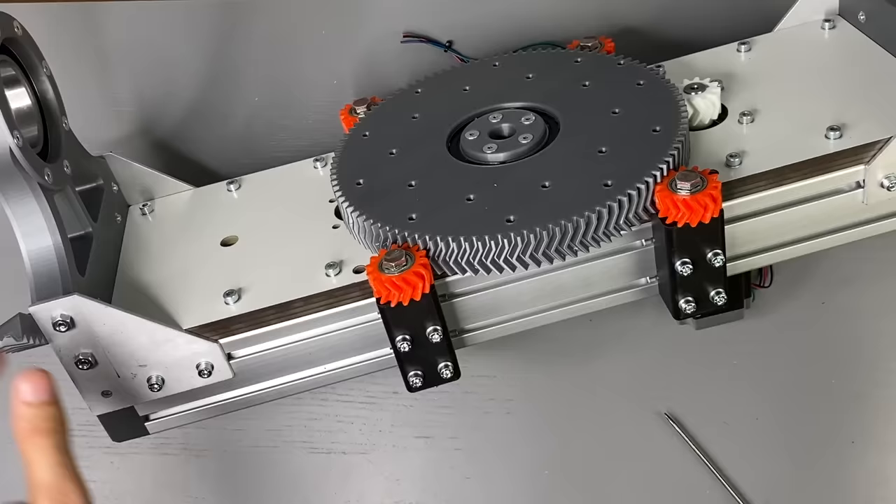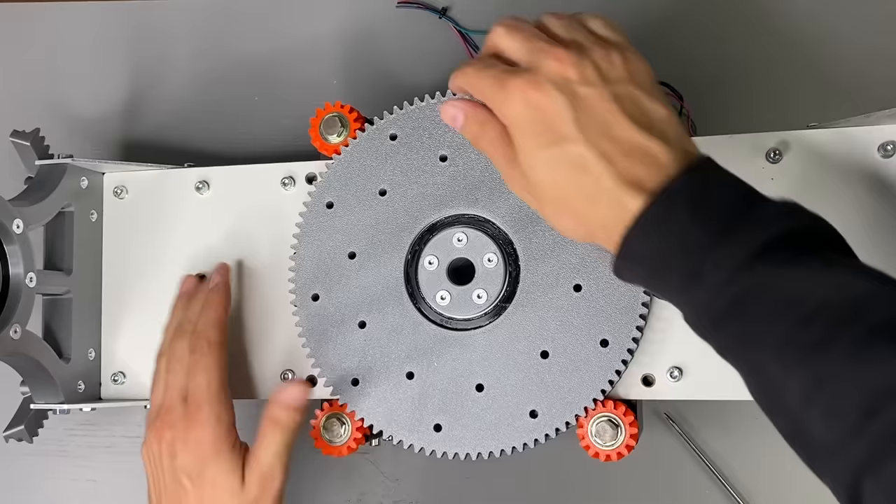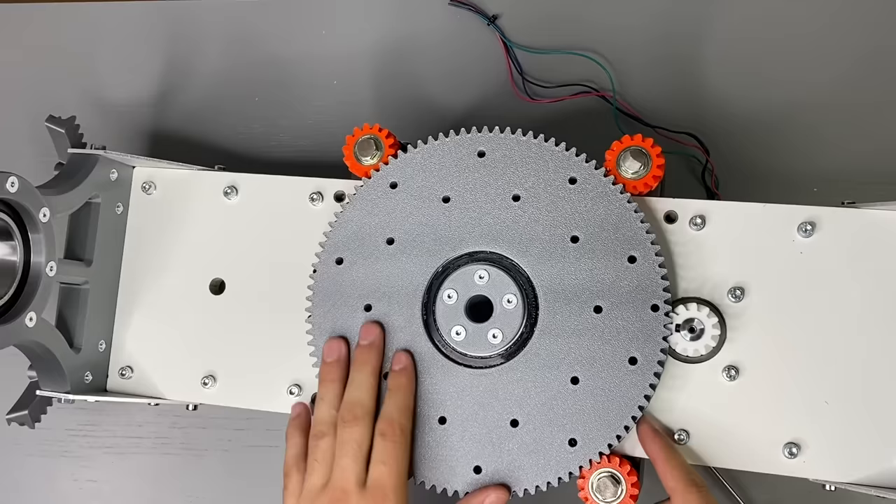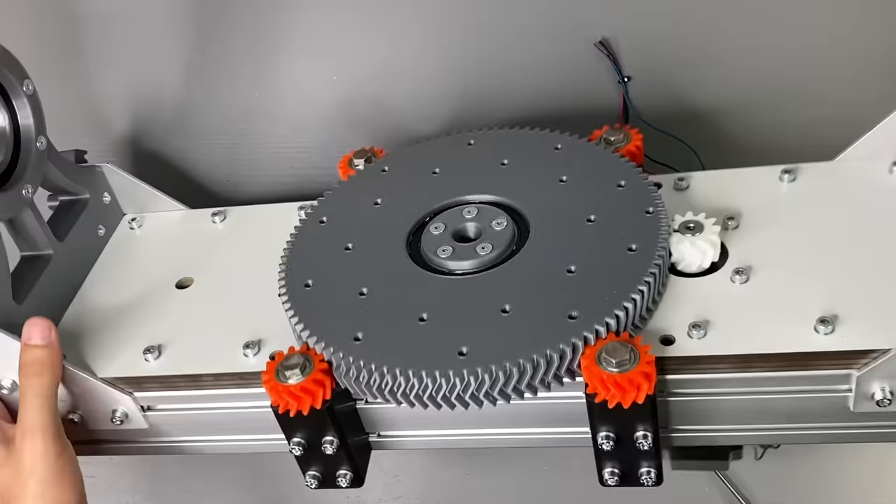Because of the shape of the orange gears, the turntable can't wobble. So it combines the radial accuracy of the standard bearing with the planarity provided by the orange gears. Since we shifted axial and eccentric load from the main bearing, the orange bearings might be a bit unhappy. But based on some rough calculations I think we should be fine here. And instead of a few hundred euros, it costs 8. So it's at least worth a try.